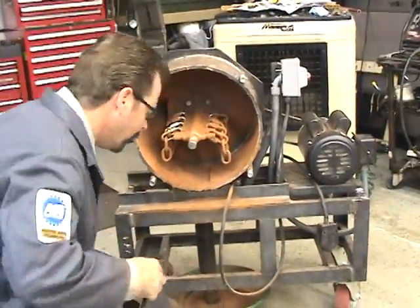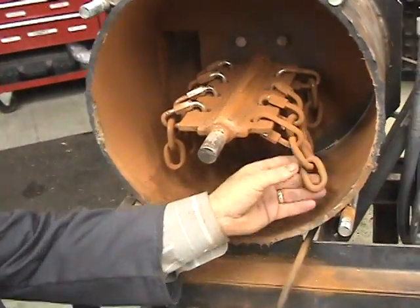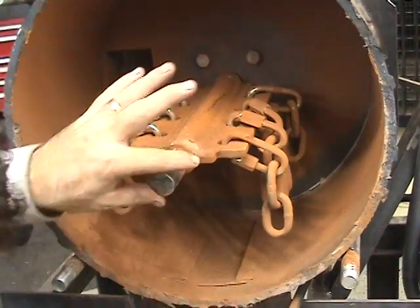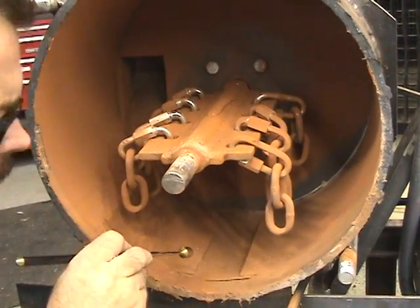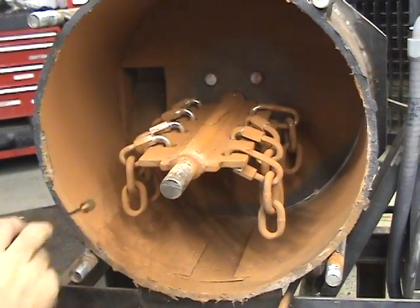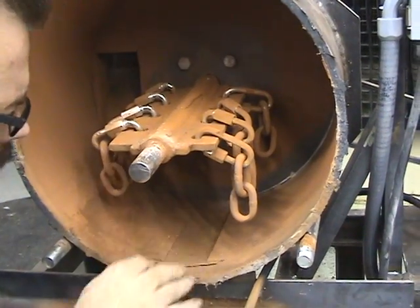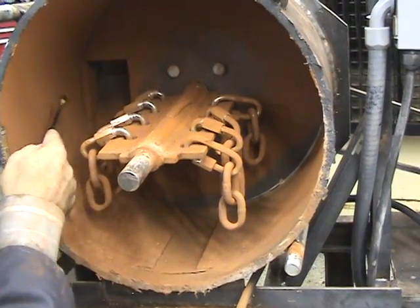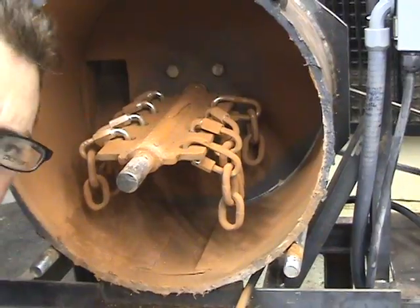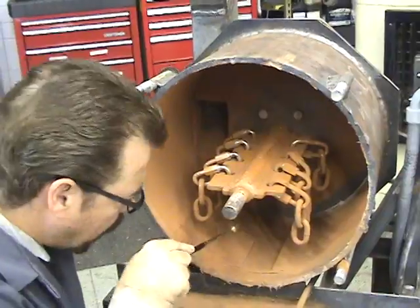Now, take a look. We have eight chains, all hardened steel, all bolted and connected to the center shaft, which is the one-inch hardened steel. On the inside, we have the punch plate, which screens it down to minus 50 to minus 100, single pass, first time. Now, the only bad design about this is that the screens should be on the sidewall and not on the bottom. They collect a lot of material, and eventually the screen becomes damaged because of that. So if you're planning on building one, I'd highly recommend putting the screen on the side and not down at the bottom.